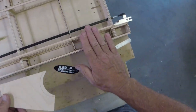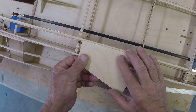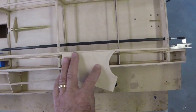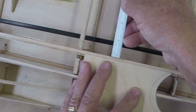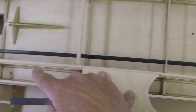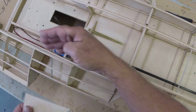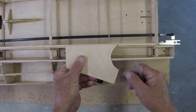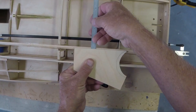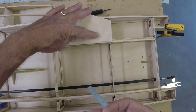When you're laying your decking on this portion, I want you to leave, do we have a ruler? We do. I want you to leave 1/8 of an inch. Cut this nice and straight. Hopefully you built your boat nice and straight. Even if you didn't, if this underlayment here is kind of crooked, make this deck piece really nice and straight, leaving 1/8 of an inch. You're going to overhang it by 1/8 of an inch. You're going to do the same over here when you attach it.